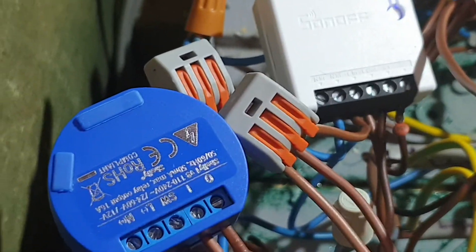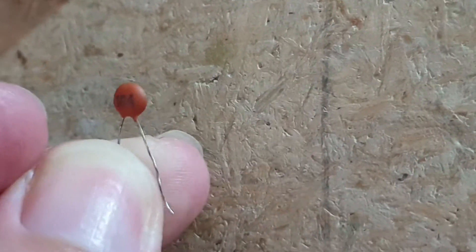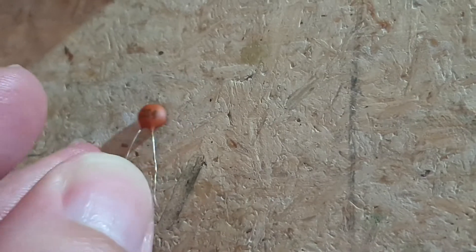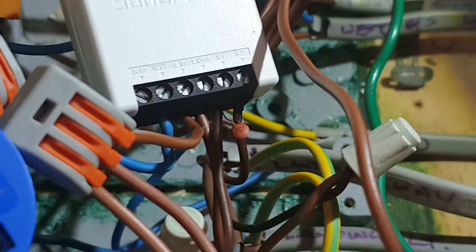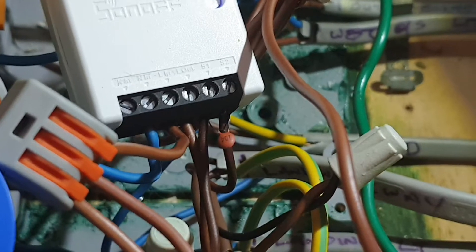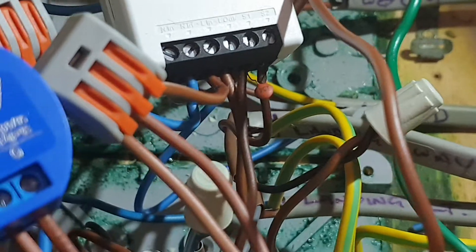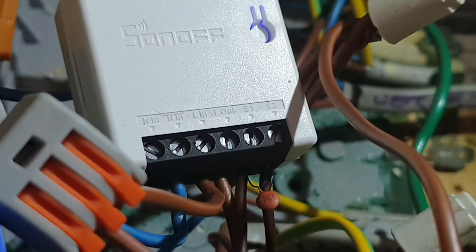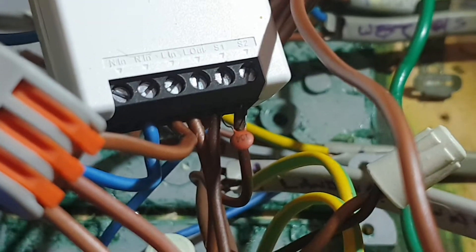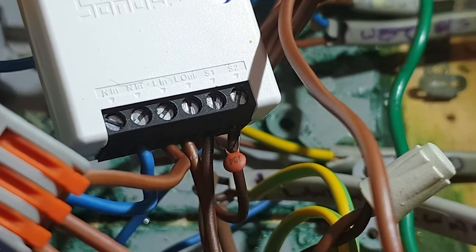Here's one — very small, with very spindly little legs on it. That works for a lot of people, but it hasn't worked for me. I've put it in and sometimes you turn the switch and it works, but you need it to be reliable — 100%. It was one out of four goes, so that's not good enough. Those spindly legs make it hard to get a good contact, so you're better off actually soldering it to the two wires before inserting them, so it gives you a nice solid contact.